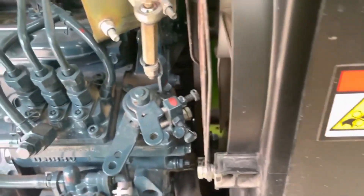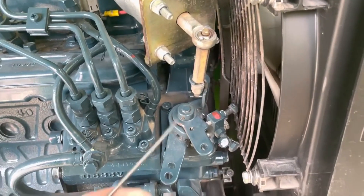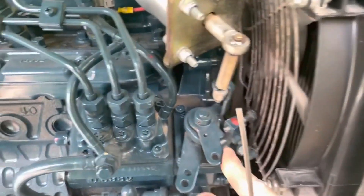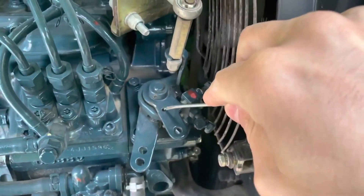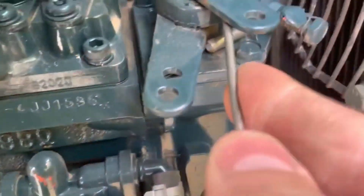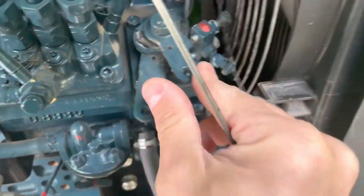The problem I see here is this spring right here — that has to be removed. When this spring is fitted it works in the opposite direction, forcing the lever the wrong way. The solenoid thrust is open in this position and it's not moving as freely as it should. So this spring must be removed. Disengage it and you can cut the tip of the pin off so no one tries to re-engage it.